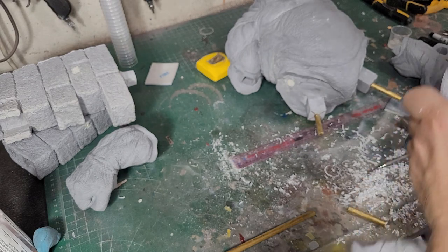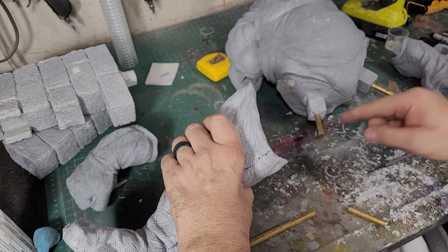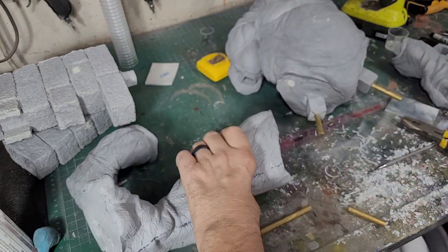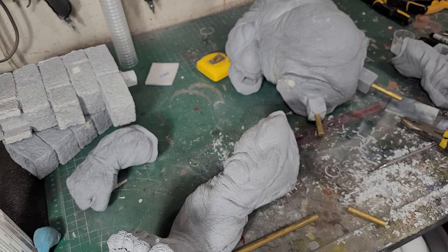I don't care if these holes are bigger, because I'm going to fill these holes with epoxy. When I connect everything, the epoxy should ooze out of this hole and fill this key, and hopefully I glue everything together nice and firm. So we should have a really good joint here by the time we're done.